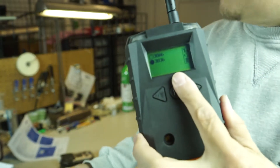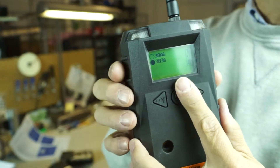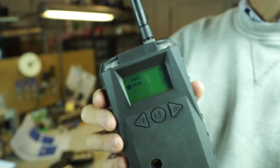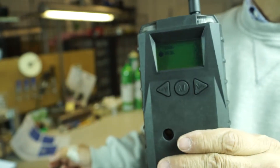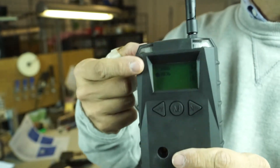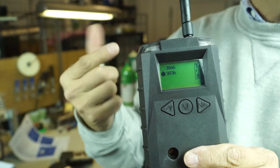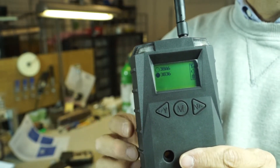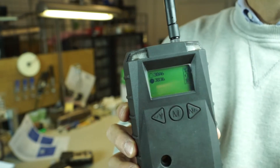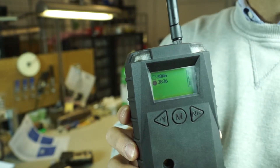EchoView is a very useful tool — that's the basics of the system. To turn them on: turn the EchoView on first, then turn your gas detector instruments on. It automatically finds each individual instrument on the same channel and same PAN ID, and it takes about two to three minutes for them all to file in. But once you get them, it's locked up and it's good.